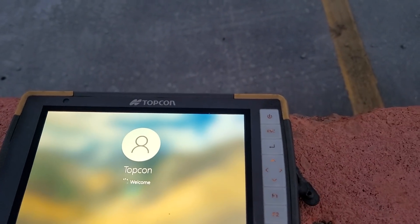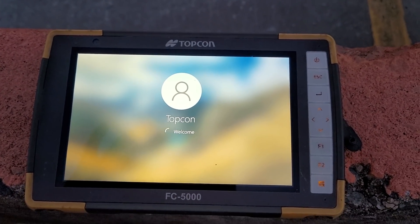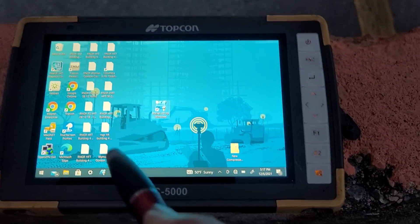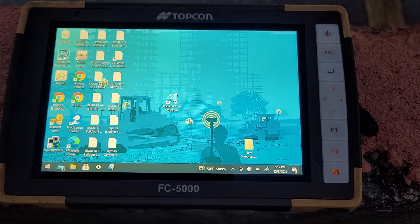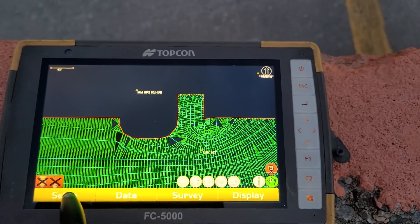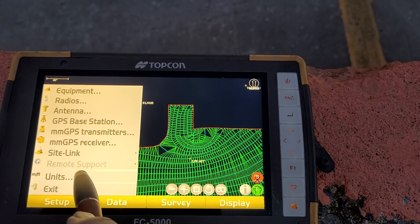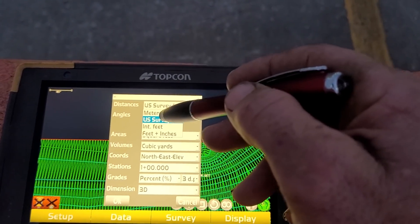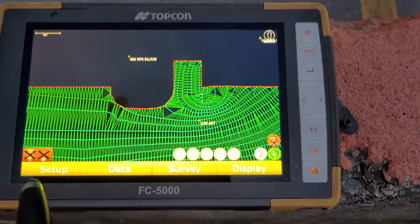It comes up — give me one of them styluses. Go down here, hit the Topcon signal symbol one time; it takes a minute to come up. It's already on the job. You can hit Data and make sure the project is Harbor Freight Wayne Brothers — that is correct. This is US survey feet, even though it's in South Carolina. Your choice is US survey, meters, feet/inches, or international feet. This one's US survey. Now we're going to hit Setup.